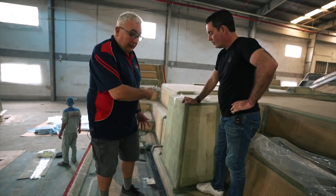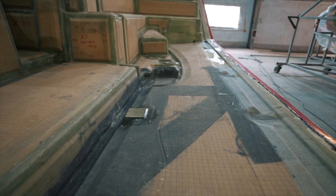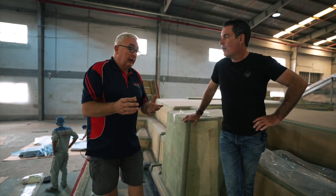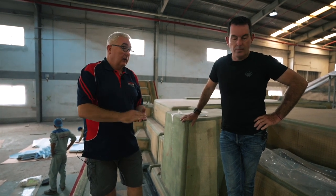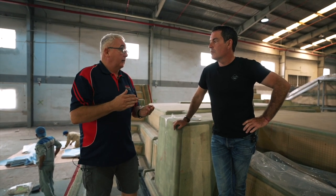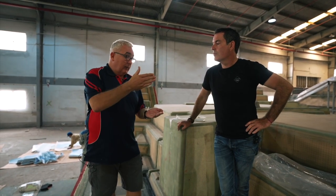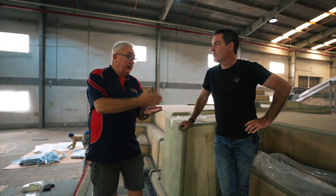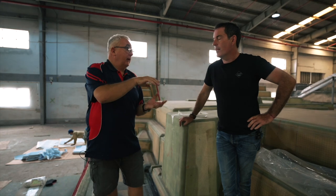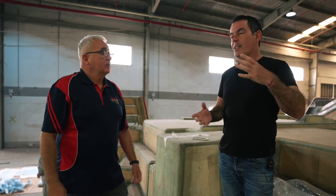You can see all the black areas — we've got the shrouds here, the coach roof housing, and the main part is where the mast bulkhead comes, so everything ties in together. Most of these areas, especially around the mast, use what we call a pad laminate — a very thick beam laminate that runs across the boat. The mast bulkhead joins into it, and the same situation exists on the hull, which runs across the hull and the mast sits into that. So you end up with a pad laminate under the mast bulkhead and above the mast bulkhead, which creates an I-beam — a very strong, stiff structure.